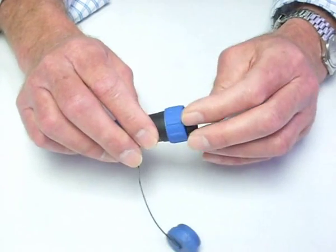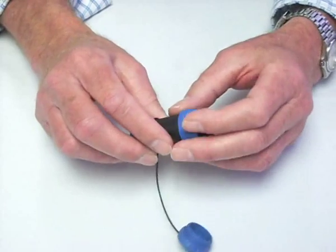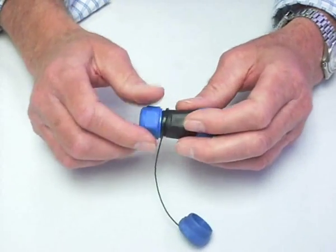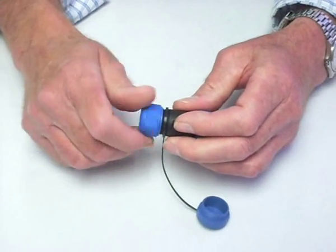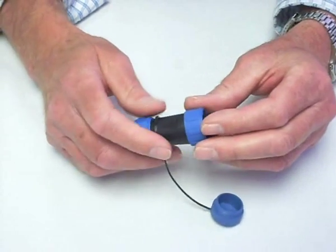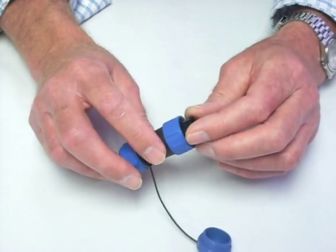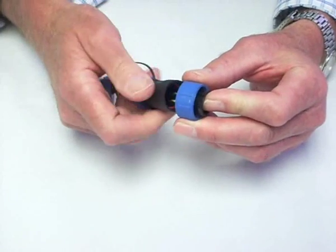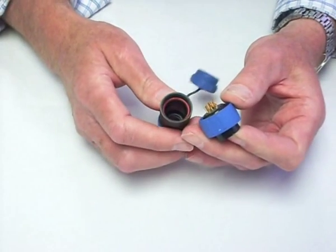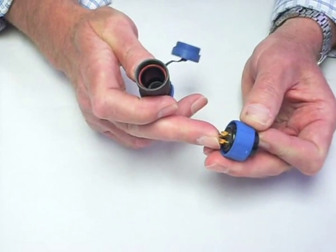These connectors use a combination of dual O-ring sealing, high temperature inserts and grommets and a compression nut on the back. That means that all insulator and contact areas are fully sealed against environmental elements. The dual O-rings mean that the integral backshell can easily come off to allow accurate soldering of the incoming cable to the solder lugs.